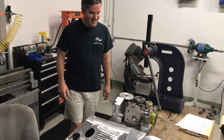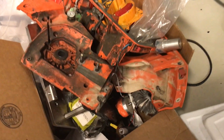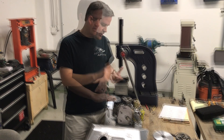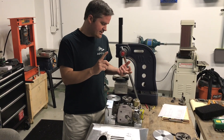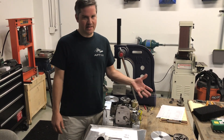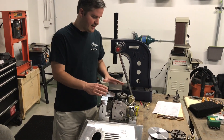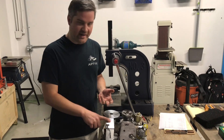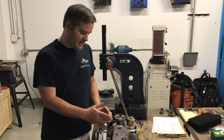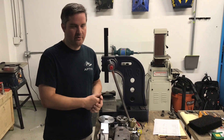So Mark, how long does it take you to make an engine for IceWave? We actually tear apart the concrete saw that this comes out of — we steal a few parts from it. It's a concrete saw from Husqvarna; they're actually one of our sponsors this year, which is really cool. We use the crankshaft and a few other components like the carburetor. It takes us about one evening to take apart the saw and build one of our custom engines, including all the extra bits. We add an electric start, and we add a microcontroller for the timing of all the electronics and the starting. We have electronic ignition and a servo controlling the throttle so we can control it with our remote control.